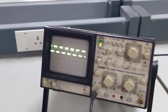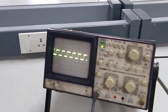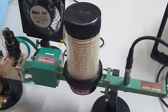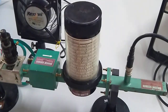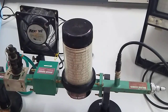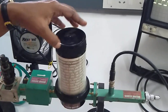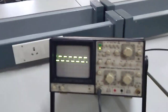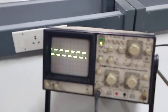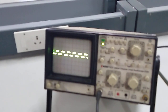After that we are going to measure the frequency of your microwave signals. This is your frequency meter. The range of the frequency meter is 8 gigahertz to 12 gigahertz. If I tune this frequency meter you will be getting some dip in your waveform. You can see here — I am adjusting your frequency meter a little bit. You can see the square waveform over here. It is going to dip now. So I am adjusting the frequency meter slowly.